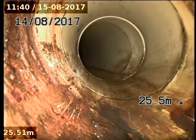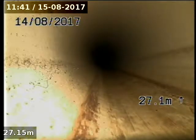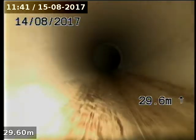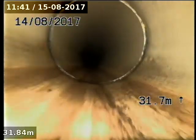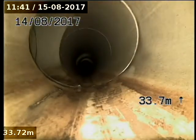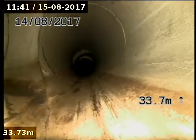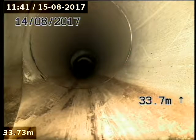And that's 0.5 deep, just next to the driveway, 5-degree bend here. Another 5, continuing straight up. And that's the first junction we come to, which is 0.7 deep in the garden, next to the steps up to the driveway.